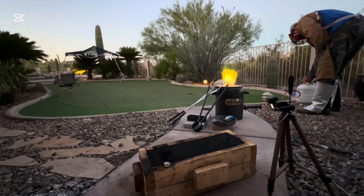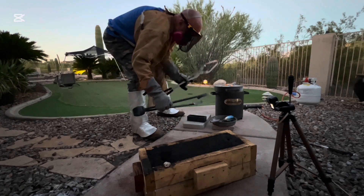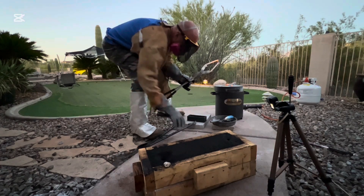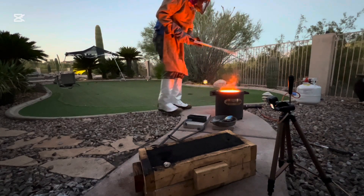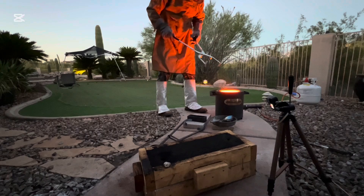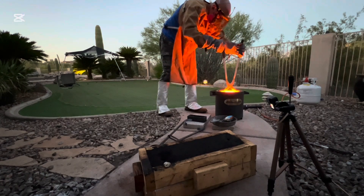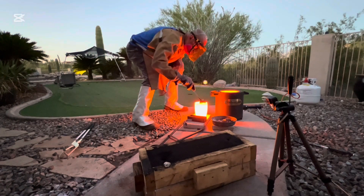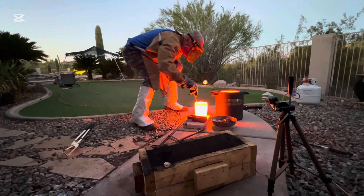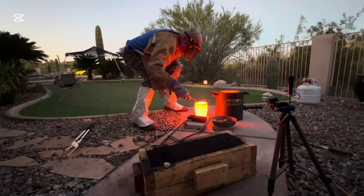When I had liquid bronze, I turned off the furnace and then got ready to extract the crucible. I wear a whole bunch of protective gear when I do this. I'm particularly worried about my shins and feet because I have had splashes — that's why I wear aluminum spats and shin covers. I also wear a face shield and a smock because the heat is so incredible coming off this stuff. I pulled the super hot crucible up out of the furnace. At this point, I had to work very fast because I wanted to skim the slag but at the same time not allow too much heat to escape from the molten bronze. I have to keep the liquid metal hot enough so that it flows readily into the shape of the dagger in the sand, and this is especially important with a thin thing like a knife blade.